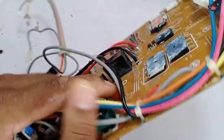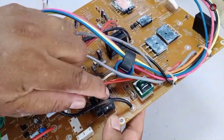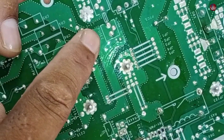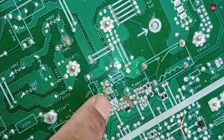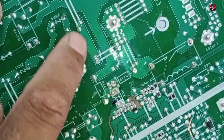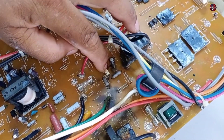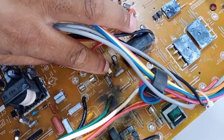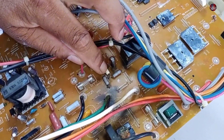The switching relay has also been blown up. Before the CT, a fuse is installed. This fuse is connected through this print. Two resistors, an optocoupler, and another small resistor are installed — this circuit is made for electricity sensing. If the electricity flows with proper polarity, this optocoupler will not go bad, but if the polarity is wrong, the optocoupler will go bad because it has an emitting diode which needs the correct electric polarity to work.